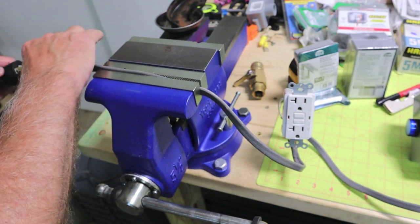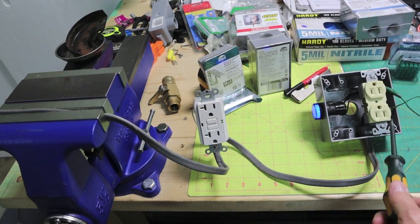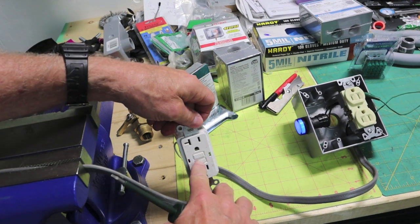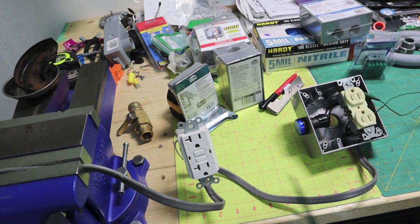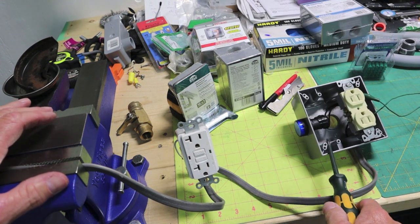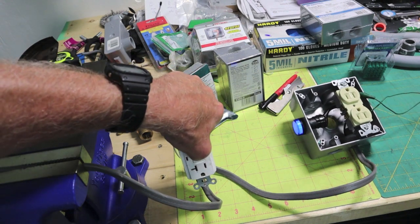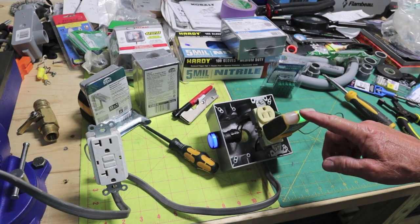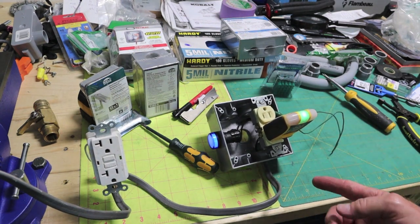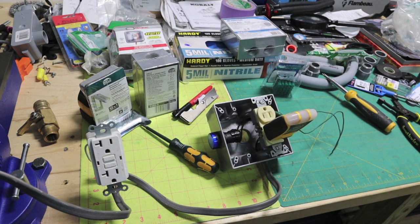We're going to energize the circuit. Right now everything is normal — we have 120 volts here and 120 volts here. This is what we expect to see. There's our indicator light. Watch the indicator light when we trip the breaker. We lose our 120 volts. Now luckily, where this is situated is where we go in and out of the house all the time, so especially at night, once you get in the habit of looking at it, it should stick out like a sore thumb. We have a nice bright green LED which indicates proper wiring. Here's a button on the bottom — we'll push it and see if it trips the GFI. It's supposed to. Yeah — everything's working as it should.